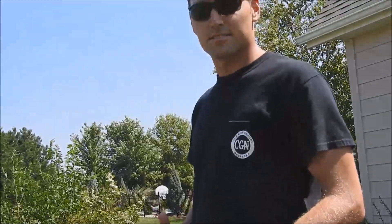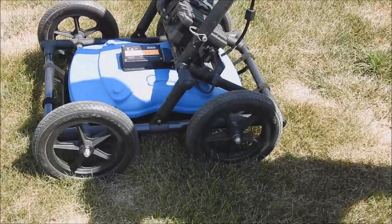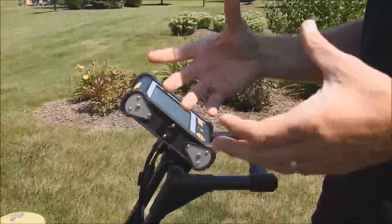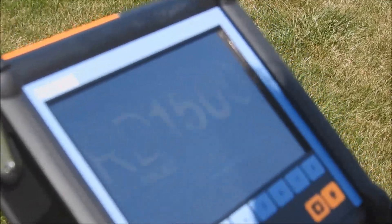What the ground penetrating radar does is it works a lot like a fish finder. It's sending a radio frequency into the ground and it's being reflected at the tops of the lines that we're looking for. It's actually using microwaves — anywhere around 150 megahertz and 300 to 500 megahertz — shooting lower and higher frequencies in bands at the same time and looking for responses.